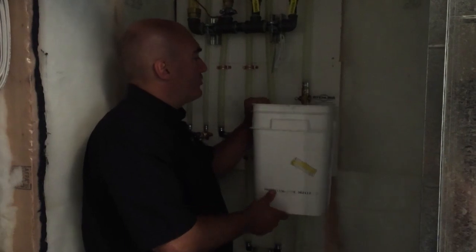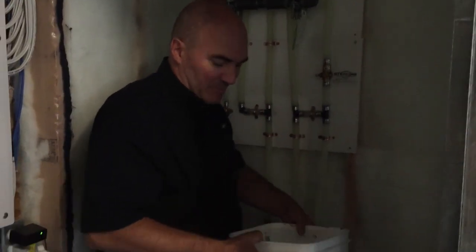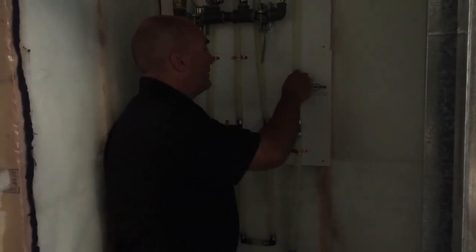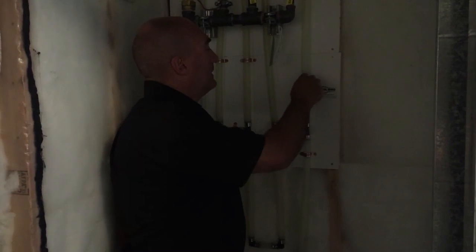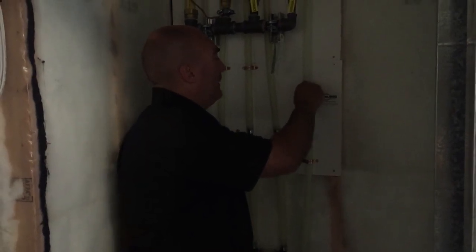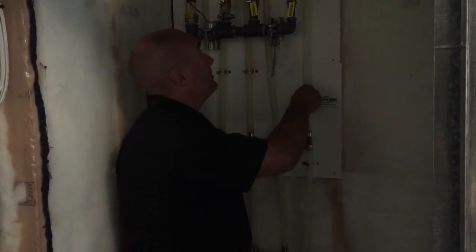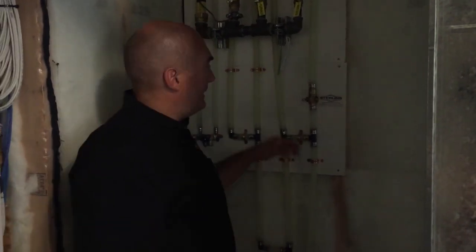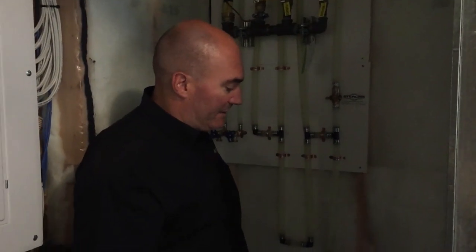Okay guys, so this is now drained. There's probably a few cups of water in this bucket, so that gives you an idea of what you're looking at. I'm going to put the discharge plug back in. You should be okay after that — make sure you finger-tighten that. At least you know where it is and you're ready for next season. I'll see you next time.